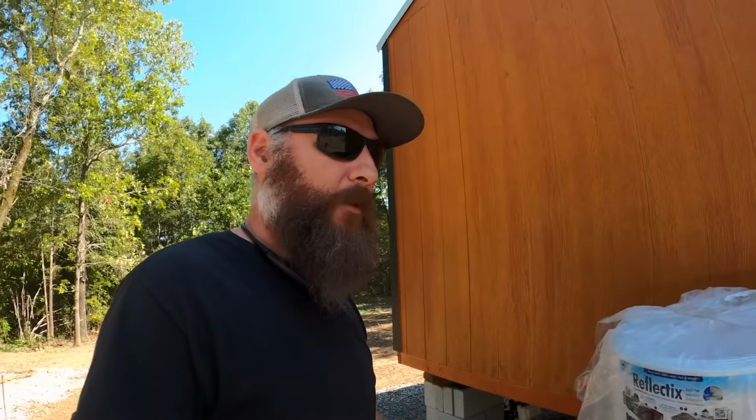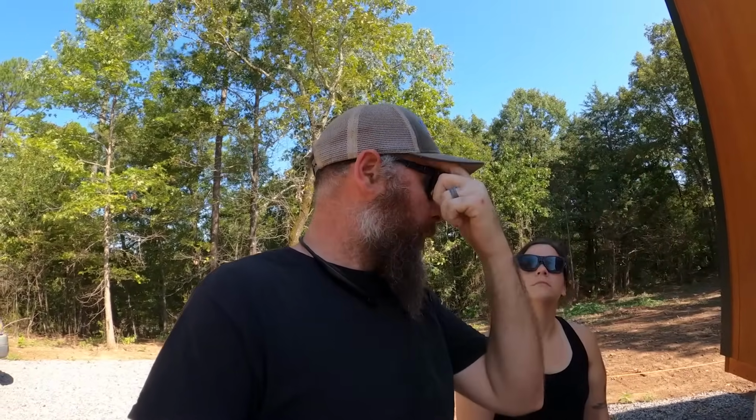It's for, like I said, vapor barrier. It's going to go on the tin roof on the inside. When they install this stuff, normally you'd put it on top of the roof and then the tin, right? But obviously, I'm not going to rip off the roof just to put that down and put the roof back on. I probably wouldn't put it back on right, and it'd leak. My luck. So what we're going to do is cut it in sections, put it in between the rafters, and staple it into the 2x4s on the rafters inside there. And that's going to keep some airflow out of that top peak vent, pretty much, so there's not going to be moisture build up.